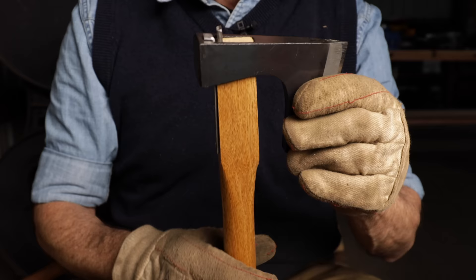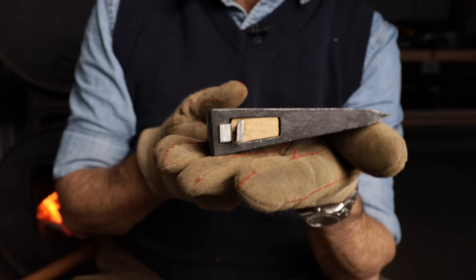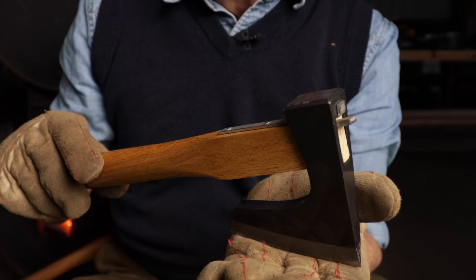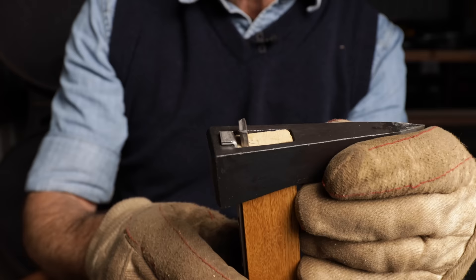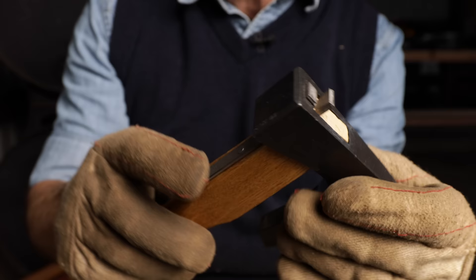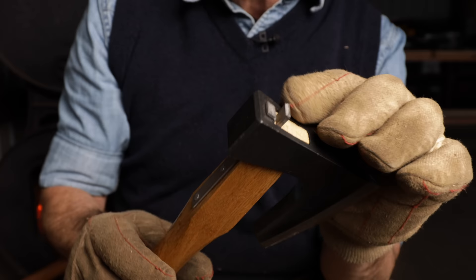The fascinating thing — the reason why I ordered it — is that I had never seen anyone try to attach a wood handle to a tool like this before. It is beautiful. When you look at it, you can see right back there on the spine there's a piece of flat bar that runs through the eye and has a little 90-degree turn on there, and it makes complete sense. They've driven that down in there and put two small brad nails in there to hold it. There's no way for the axe head to slip off the end because it's being retained by that metal clip.